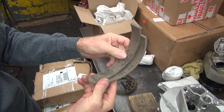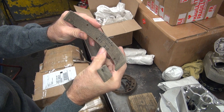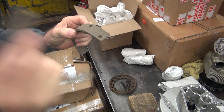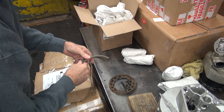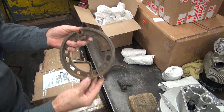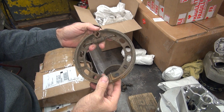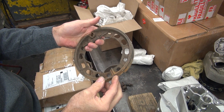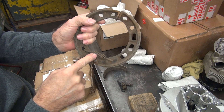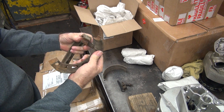So this is brand new asbestos brake linings. What year are these things from? 1933. Late model stuff - very best brand. Oh yeah, they're definitely asbestos, you can smell it. Good stuff, that's the stuff that works. No linings, no shoe rivets. These are the old brake shoes for a 45 - for front and early rear. The difference between earlier ones and the 20s is they changed the rivet patterns around a little bit. And this here looks like a kickstand spring for a 45, otherwise known as a jiffy stand spring. That is not a brake shoe spring, but that's what they put in there.